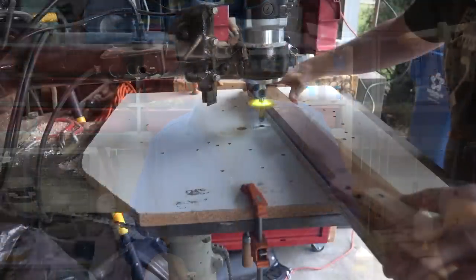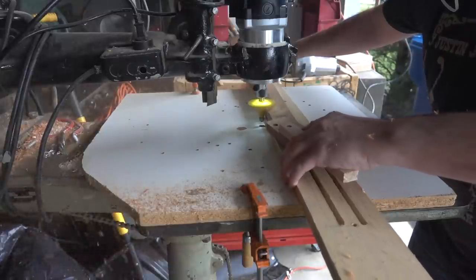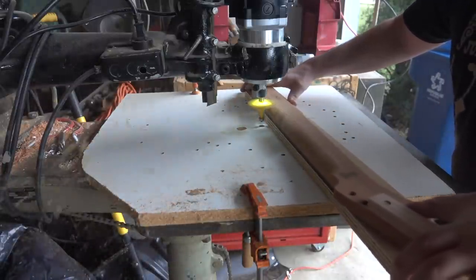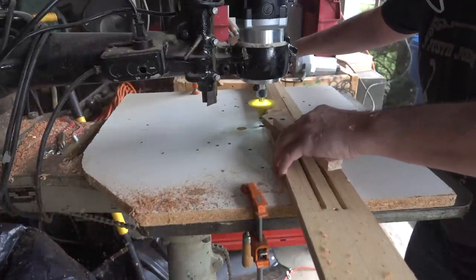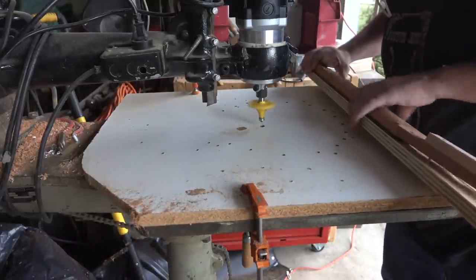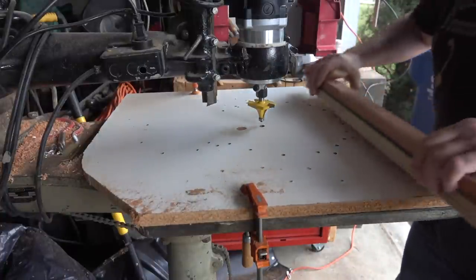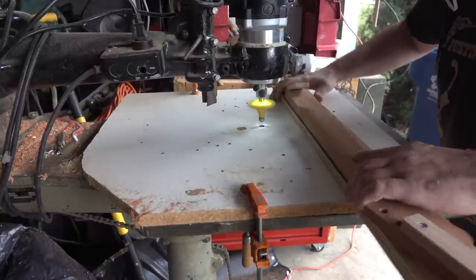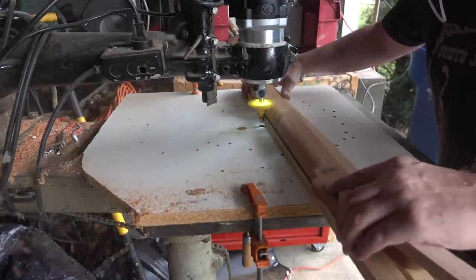Same thing with this one-inch bit — I'll show it in action here. I've got a custom jig I made which is essentially the neck screwed into a board with a straight edge, lined up to the edge of the fretboard. You don't need to take everything in one pass — it's a little dangerous to do that. You can lower the bit slowly and take little bits off. I'm taking a little time to see how it's actually routing and how it looks and feels, taking two light passes to just sort of take the edge off and get a gauge of what the curve feels like.